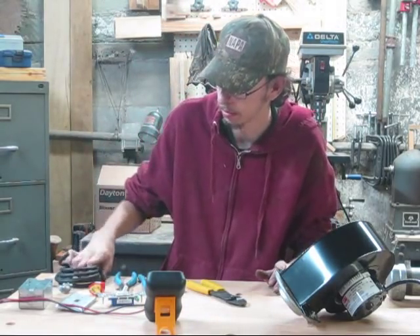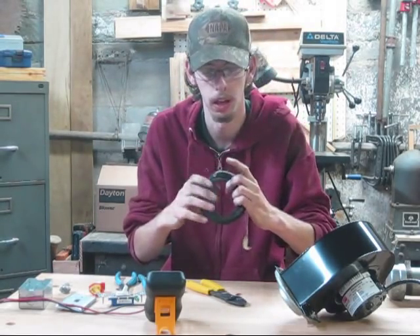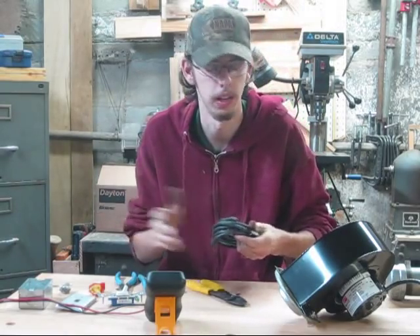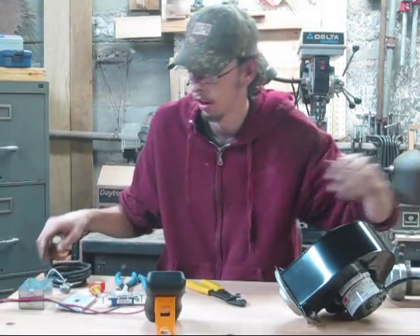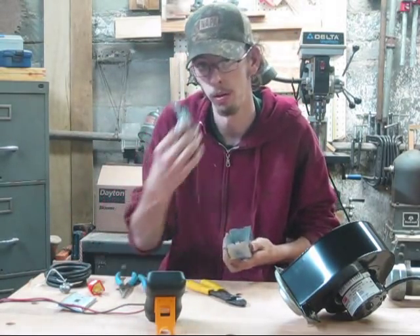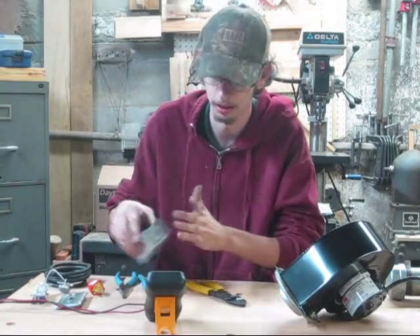The other things you're going to need — your basic supplies — you're going to need three-stranded wire cord. It'll have your power, neutral, and your ground all in the same strand. I think this is 300 volt; it doesn't have to be that heavy, but it's the same gauge as we have on our blower here. You're going to need a basic 110 outlet plug, a multi-box for your light switch that we're going to hook up to this, and you're going to need a cover. You don't have to have that, but it does make things safer.